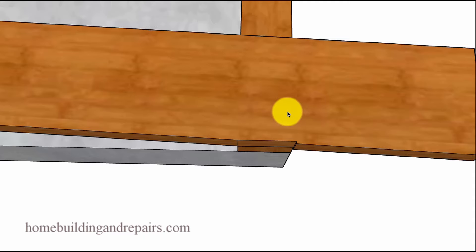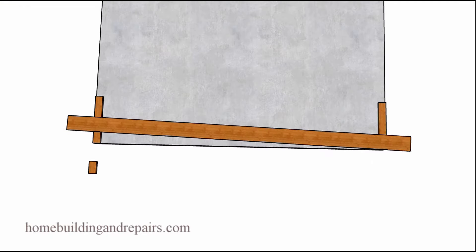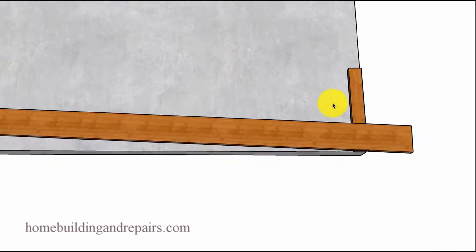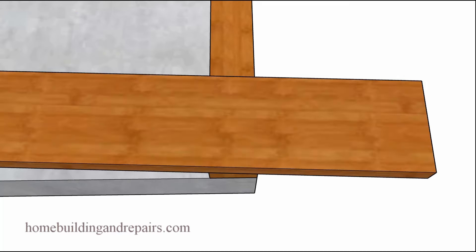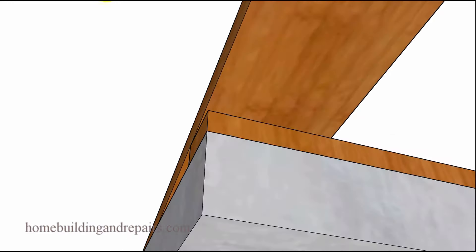Now I've worked my way up to the grand finale — the second method, which I think is going to work the best. The previous method might make it difficult to lay out and mark the bottom seat cut. In this method, instead of working from one side of the roof rafter, we're going to work from the other side with our 2x4s. We'll look at what the rafter looks like with the seat cuts laid on top of two 2x4s, which can be however long you need depending on the slope of your roof, with the edges lined up with both sides of the building foundation.